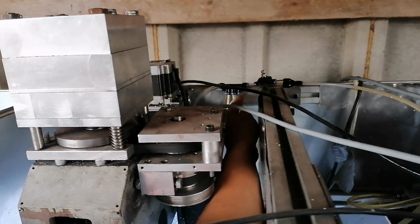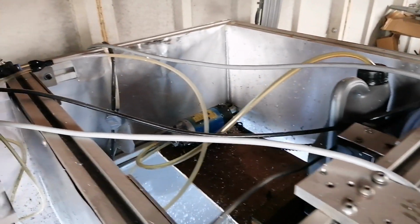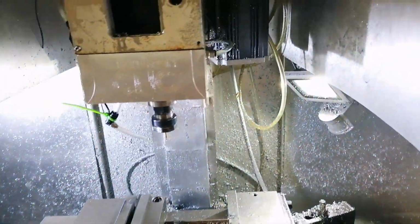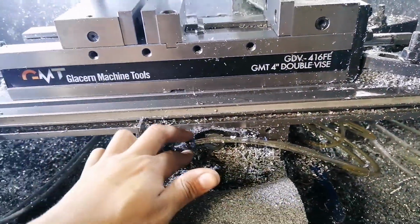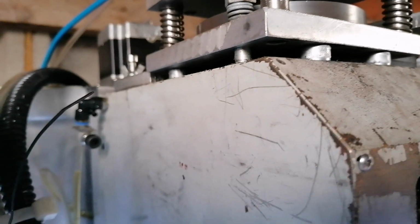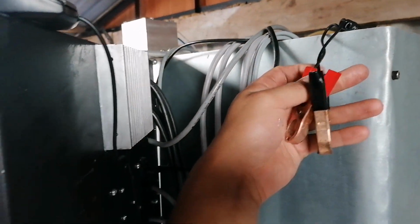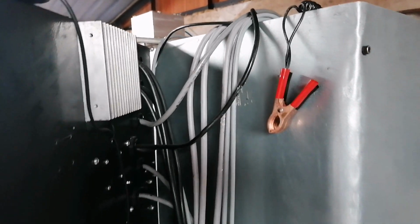At the back here we've got the automatic oiling system. So we have an oiling tub. On this side is regular oil. Transfer pump pumps through that manifold down to all the pipes under the table, which come in through the original gib locking locations. As well as we've got some more on this side. It's quite tight in here, so I'm trying my best to get the camera in. So at the moment that's just on a couple of leads that I hook on. Every time I home the machine, it just feeds a little bit of oil to everything as it moves along.